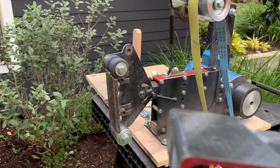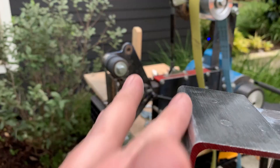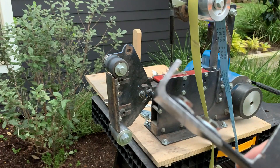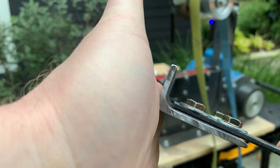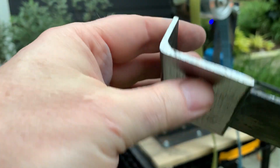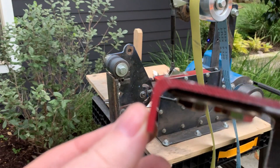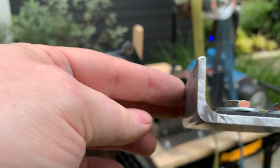I don't have a mill, so I had no way to get a perfect radius. I put this on my disc grinder, set it at 45 degrees and cut it there, then set it at 22 and a half degrees and cut it there, flipped it over and cut it again. For the rest of it I used a file and sandpaper to round it over, and it's pretty decent — good to the eyeball. You can't look at the plunge lines and tell that they're any different.